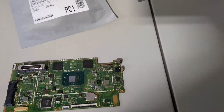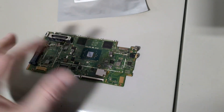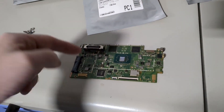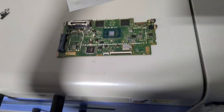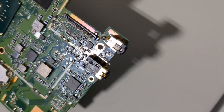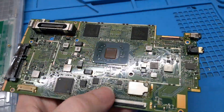I can always fudge around with the profile a little bit. The other possibility is potentially just using a regular preheater and a hot air tool to do this — it would be far easier. But I figured I'd use the big machine to see what happened, since I wanted to tear this board apart anyway to trace everything out. The headphone connector didn't quite survive either, but oh well. That chip went on fine. I am concerned about the Wi-Fi module though, because it looks like it may have floated over by one pin with the flux fluidity.